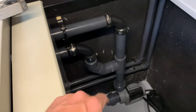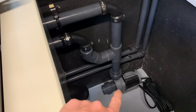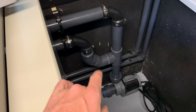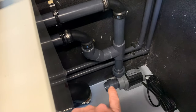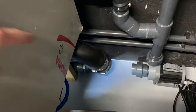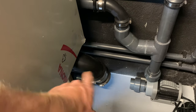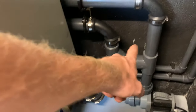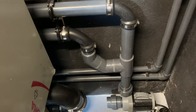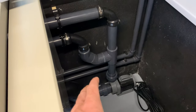I've glued up this little section, put two rubber boots on it, and I've put my pump down there. I am eventually going to get another pump and run these two lines off separate pumps, but for now I've just hooked this up as neat as I can. I've also shortened the length of this pipe, put a 90 on it bringing it up straight into the back of the drum — nice and neat. You can see I've got to paint the wall again where I've been moving bits and pieces around, but I can touch that up later.